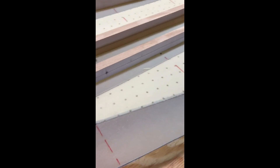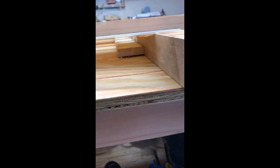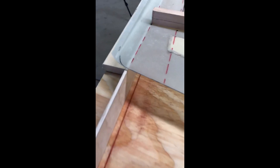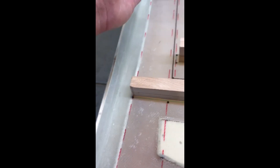The template for the ribs actually turned into a jig for the stabilizer to be built on. Basically what I've done is screwed on a little piece of one-by-two on each end to give it that stabilizer shape. You see how the skin just fits in awesome right in spot. This is where the tip rib is going to go on that red dotted line.